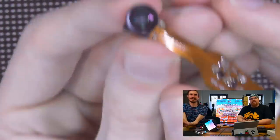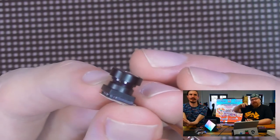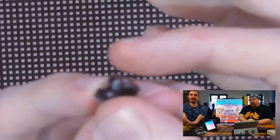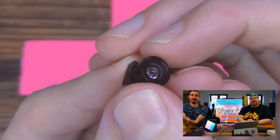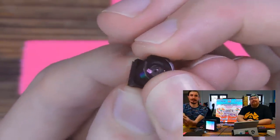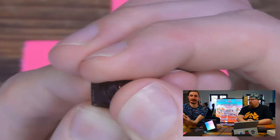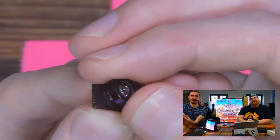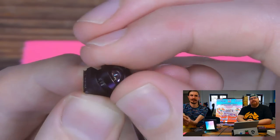It has more like a CCTV lens, and it means if you want to focus it, you can do it a lot more easily rather than using the white plastic or breaking the glue. There we go. Now we can do it on the gaffer tape instead. You basically just grab that little end and it doesn't require wrenching to unstick or removing glue. It's a screw thread focus lens that's on top of the main camera. And you can actually unscrew it all the way off.